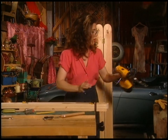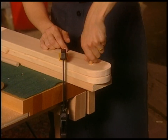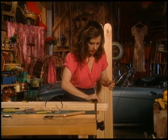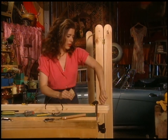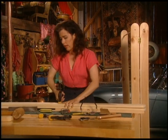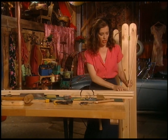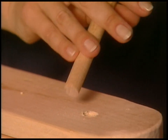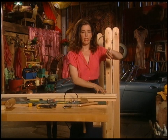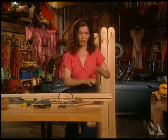Okay, I'm through. Now just take a little rolled-up bit of sandpaper and clean up the hole a little bit so that it's not too ugly. I'll get rid of the clamps and flip the boards open. The dowel — I'm just using a half-inch drill bit because my doweling is a half an inch. I've taken a little slice in the top of the dowel because it fits into the hole better if it can compress a little bit; otherwise it's a very tight fit.